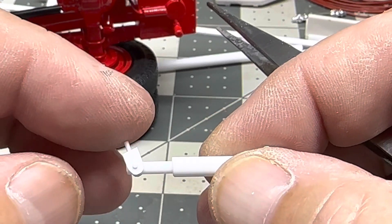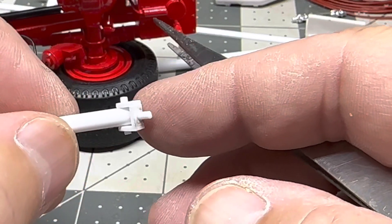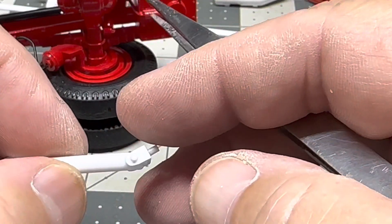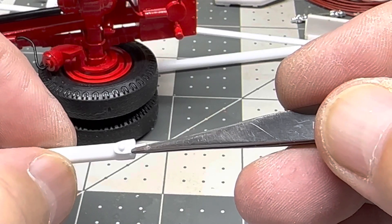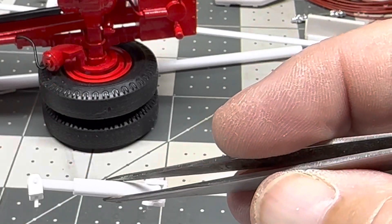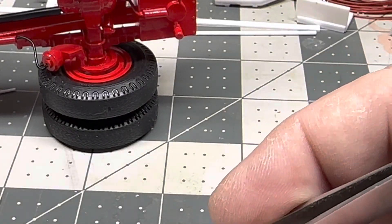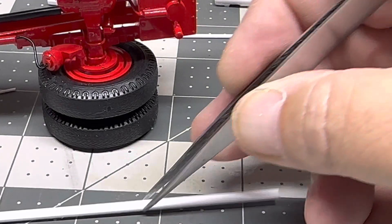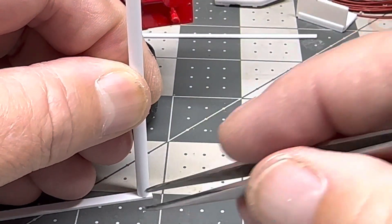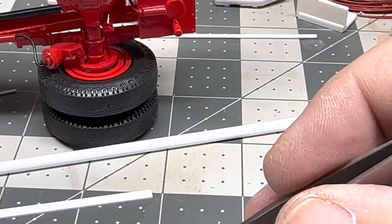Both ends do function and it was really really easy to make — probably only took me 10 or 15 minutes. What I used on the — what is this called — a yoke, I guess. These three pieces are 40 by 125 styrene. What I did was I took the first piece, sat it right underneath the tubing that I wanted, then took my knife and just cut right here on the edge of it. Then I cut two more pieces that were a little bit longer that became my side pieces.